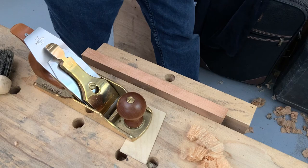Mr. Lynn's feeler gauge trick works, and works very well. The metal feeler gauges are more durable than the card, and the whole process feels more consistent and reliable. However, setting those gauges in the guide can be a bit fiddly, so practice as much as you need before putting blade to stone.